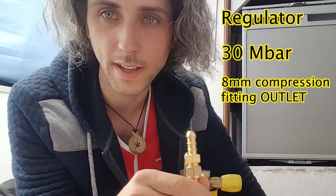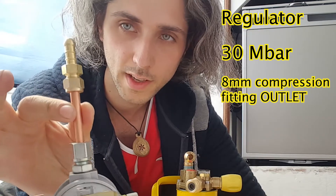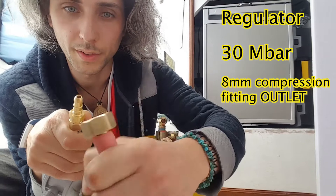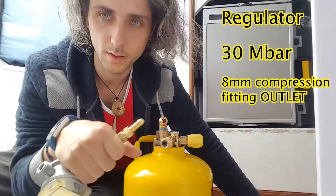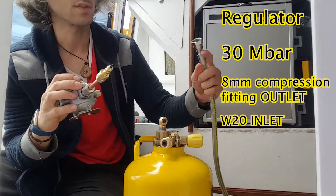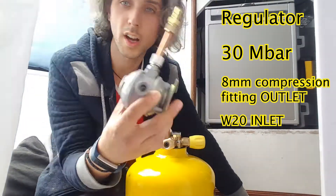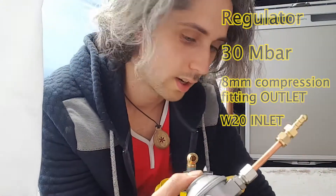The regulator connects to an outlet which is an eight millimeter compression outlet. You put a copper pipe fixing in that, it screws in, the metal compresses and it's solid. Then you've got an eight mil to the standard nipple that goes onto these gas valves. You take one of those out, stick it in — get some silicone spray if it's hard to push in, but generally just give it a shove and it slips on. The inlet for this is W20 — the same standard — so everything that comes out of your can will be W20.